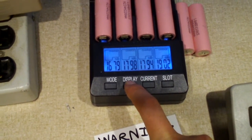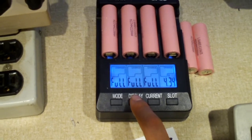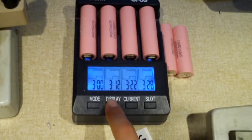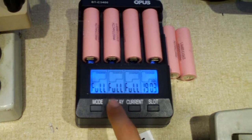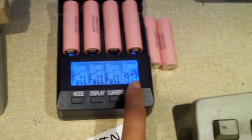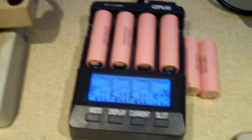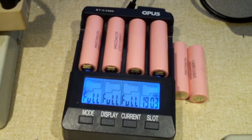The voltages on these cells were a little different going in — roughly 3.7 to 3.8 volts — and I charged them up from that. It put in roughly 1,794, 1,798, 1,679, 1,700, 1,800, and 1,900 mAh on these. I didn't actually number the cells, so I don't know exactly where they were in the pack. It was a 3 series, 3 parallel pack.